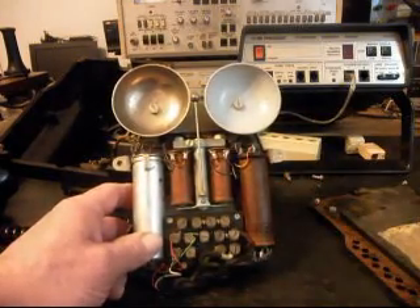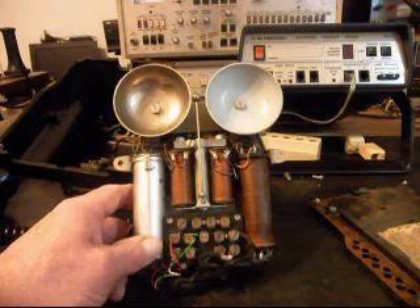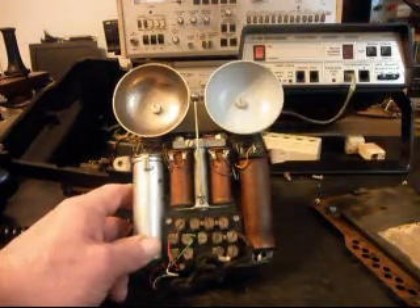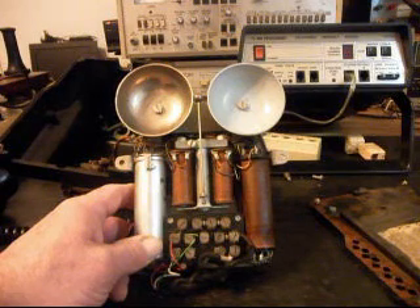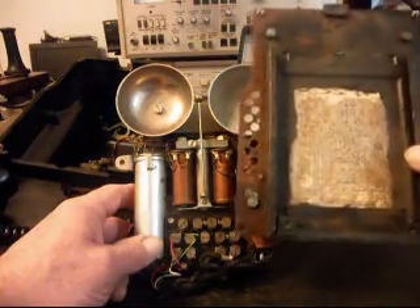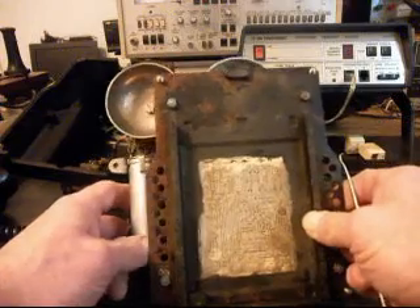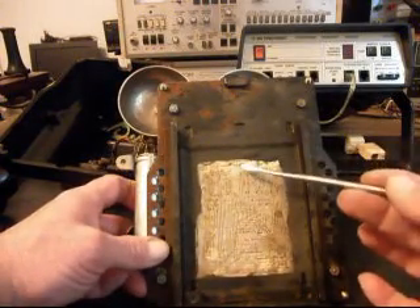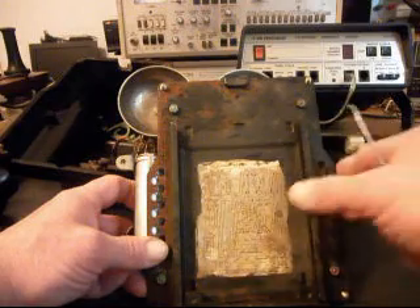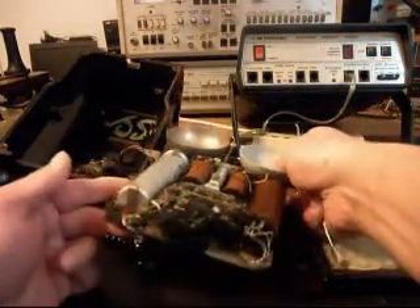You won't see a lot of these — it's a very unique phone. Whether it's an original or not, the bells will always have 2 and 2A on them, and that will indicate it's an original GPO. Also these holes in the base plate — on remakes you won't find those. This one says right here on the schematic: number 332. That was a good number for an original GPO telephone, so it's a very cool piece of the past.